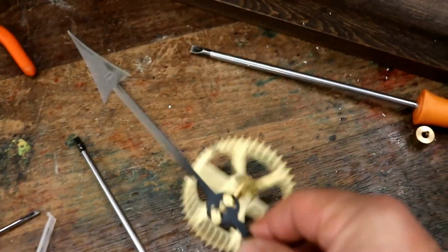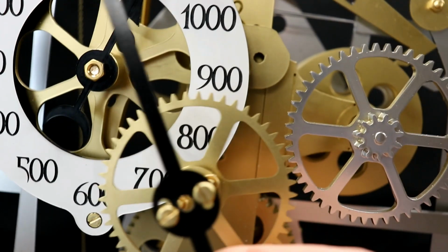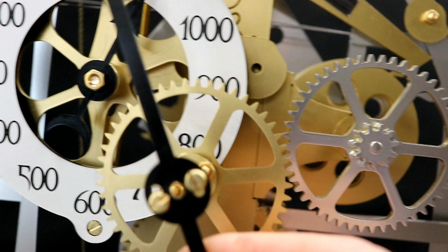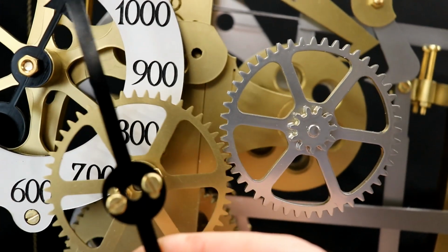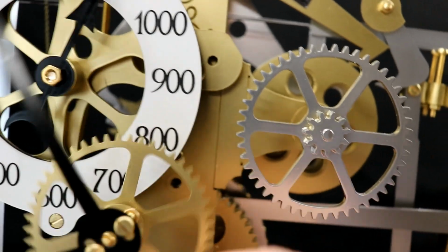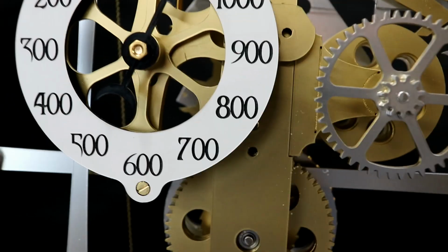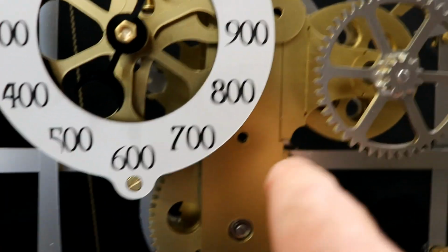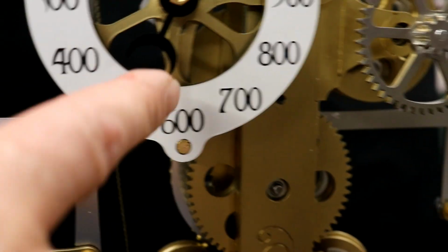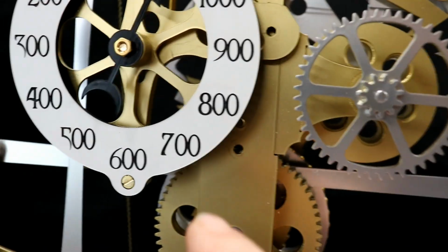And the next problem was this gear, which goes here, a fraction of a millimetre. For some reason now it's binding too tightly on that and stops every time it goes round. So humming and hawing about that. Then I noticed, in fact, that the little spindle that sticks out this hole, it doesn't bind until I put a grub screw in a hole this side. And then today I thought, I know, I've got a cunning plan.